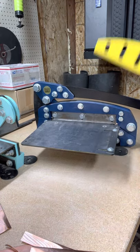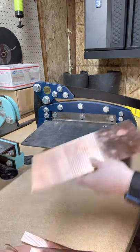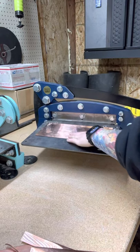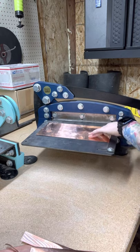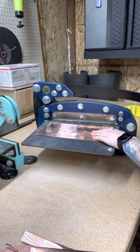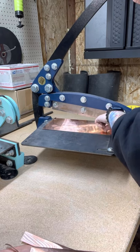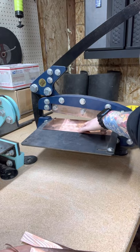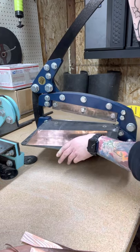When cutting a piece on the 12-inch, the operation is pretty much the same. You've got your leveling bar below, then you'll lift the handle up, slide your metal up to the score mark, line it up with the very top of the blade, and then go ahead and lower it down and shear it off. I'm not going to shear this one right now, and there's a good reason - I left it this way on purpose because I wanted to show you something.